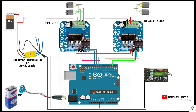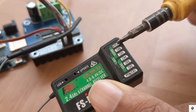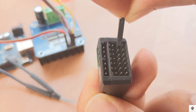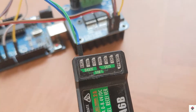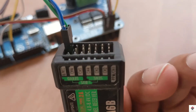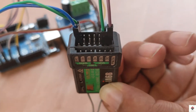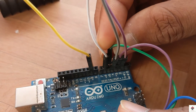Moving further, to power this receiver I'll be using the B/VCC port. Here the center pin will be plus 5-volt and the bottom one will be the ground, so these two also go to the common plus 5-volt and ground on the breadboard. For control signals I'll be using the signal pins from channel 1 and 2, which are at the top. Channel 1 signal pin goes to Arduino PWM pin 3 and channel 2 signal pin goes to Arduino PWM pin 5.